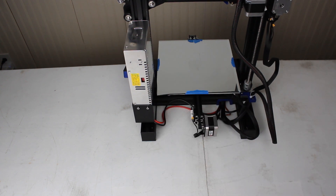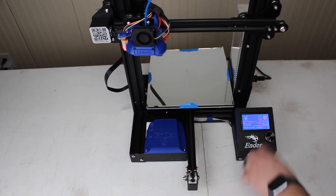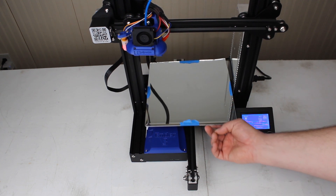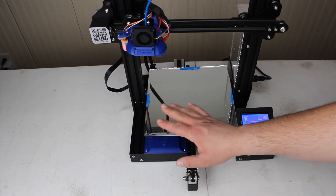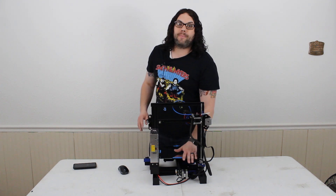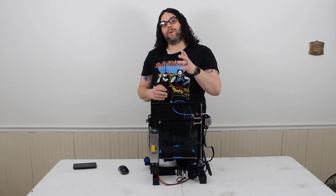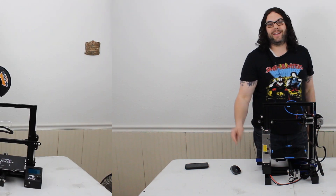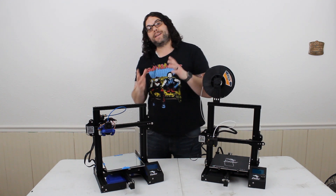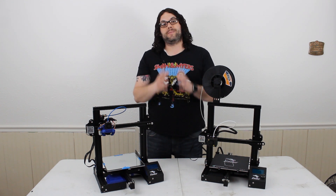The next thing we need to do is plug this in and power it on to make sure everything works. We powered it back on — everything came up great, no smoke, which is great. I'm preheating for PLA now and we can see the temperatures rising on both, which is awesome. We now have 12 gauge silicone wire and no longer have those dangerous XT60 connectors. You've successfully replaced the wires from the power supply all the way to the motherboard on your Ender 3. I hope you learned something today — keep printing! If you like the video, hit the like button, click subscribe, and hit that bell for notifications. We're almost to a thousand subscribers and I'm doing a big giveaway!